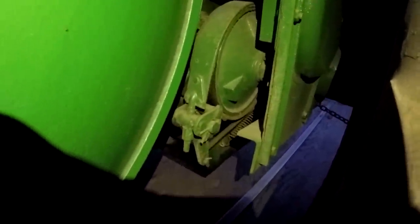Of course, we'll have to do... Oh, there's your brakes there. There's the band brake. You can see that in there. So I might just need to tighten down in here, maybe. Pull it down a little more. That'll bring it tighter. There's an adjustment bolt I see there. Of course, it's all painted up, but they probably need tightening.